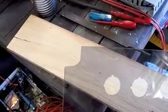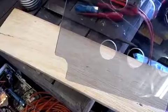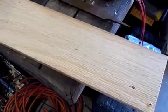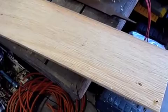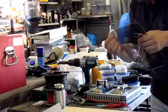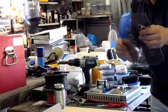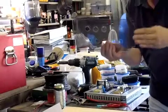Currently all I am doing is rounding out the holes to create the flaps that will actually curl around the iPad and hold it securely in position. Underneath is the piece of timber I'm going to cut down to the exact size of the iPad and use that as a former to curl my edges around. As you can see on this piece of perspex, I've already drilled 4 pilot holes, equal distances from the edges, to form my bending flaps.